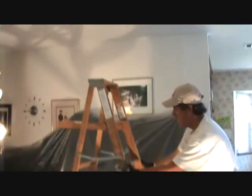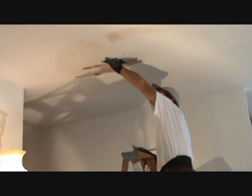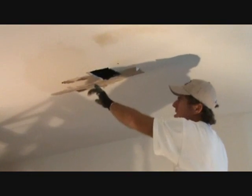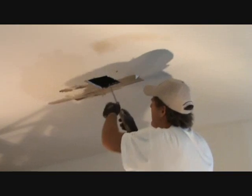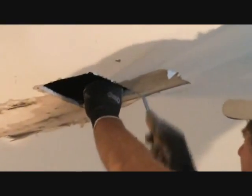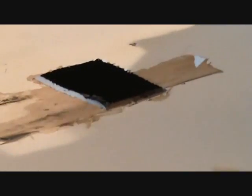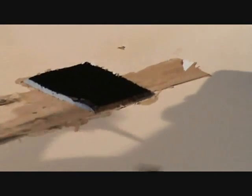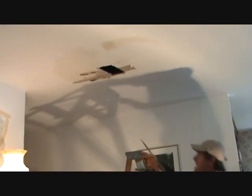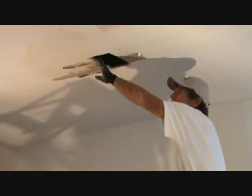Okay, we've got a hole in the ceiling now. This sheetrock looks pretty thin too — I think the back side has been eaten away. I'm going to cut right to that edge where the tape goes, right along the joints. The four-by sheets of sheetrock are going this way and the joists are going this way. Those ceiling joists are 16 inches on center, and usually when they do 16-inch on center, you've got half-inch sheetrock.